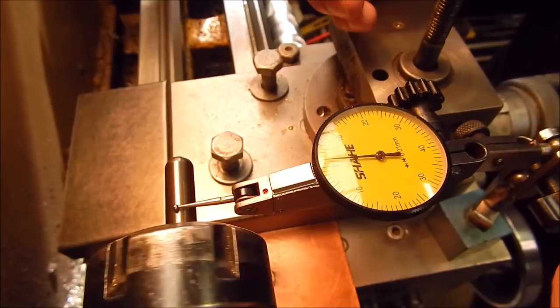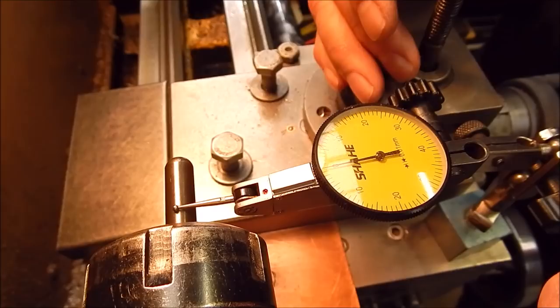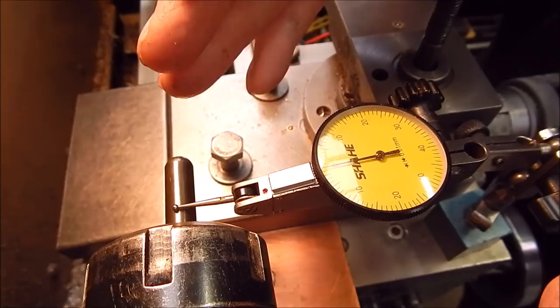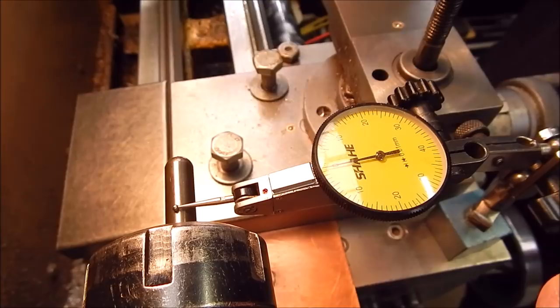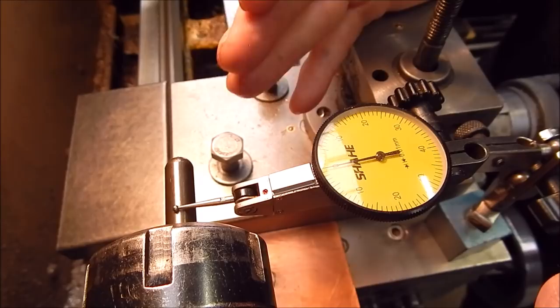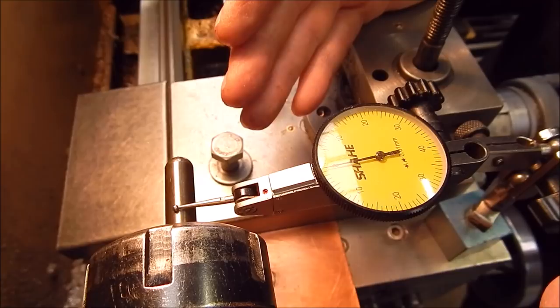There's your little tip for the day. You can either use a test piece and set it up as you want to use it, or if the collet is only used in the one collet chuck on the one machine, you can use a die grinder and put a reference mark on each collet in line with a reference point on the collet chuck. That way, if you ever want to use them again, you just put them in that position — it's the same as referencing a chuck to a backing plate. If you ever grind the jaws, you have to make sure you keep everything constant as it was, otherwise any variation will throw out the baby with the bathwater. Okay, that's it from me. I hope you got something out of it. We'll see you next time. Cheers.